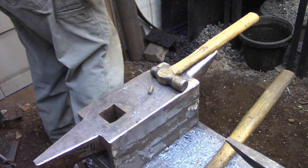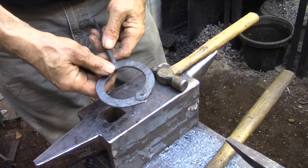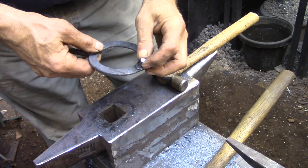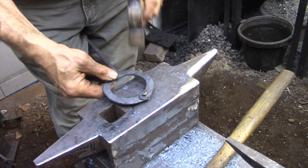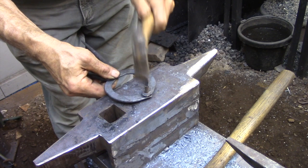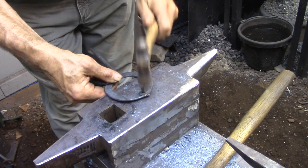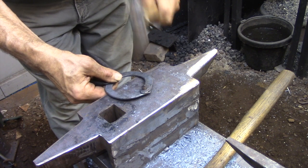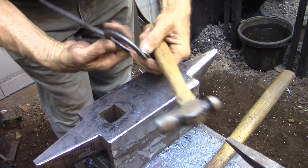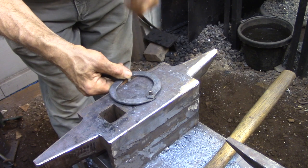The thing I like most about these dividers is that there's no complicated hinge joint. The friction comes from the two arms rubbing against each other, so all I need is a very simple rivet at the top just enough to keep the two arms under tension. The amount of spring tension you set up in the arms is what makes the dividers easier or harder to adjust. The problem I had with the original set was that the arms were so short and I left them so thick that there really wasn't any spring in that curved section, so there was a tremendous amount of tension and it takes a lot of force to get them to move. The longer arms should solve the problem because they'll tend to be more flexible.